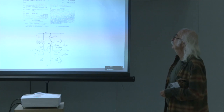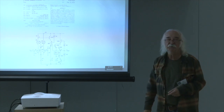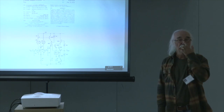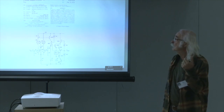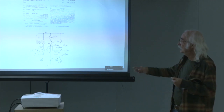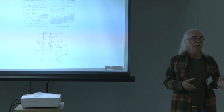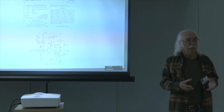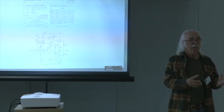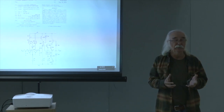This was the initial patent to describe the Stasis amplifiers, which I made once upon a time. And the idea with the Stasis amplifier is to set up the circuits so that the gain stages experience both constant voltage and relatively constant current. In other words, that's the deal.